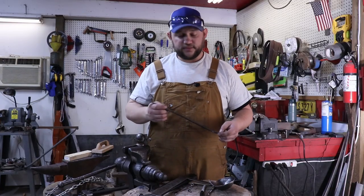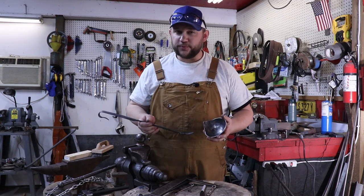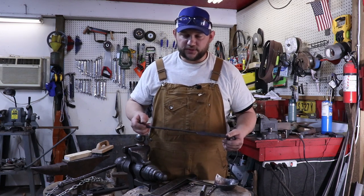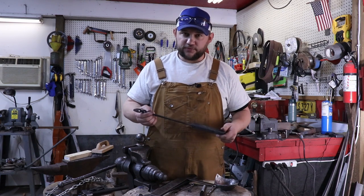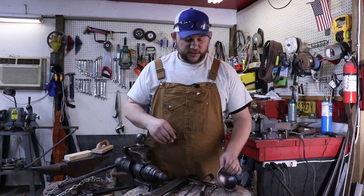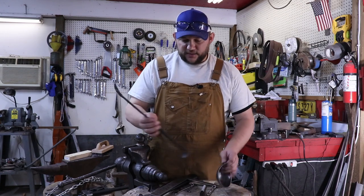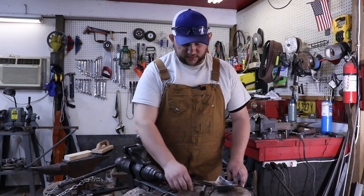Everything is drilled out. Now all I have to do is take this inside, and I need to wash it pretty good. I like to knock all the forge scale off if there is any with a wire wheel. Take it inside and scrub it a few times with just dish soap, and I'll bring it outside and then go ahead and heat it back up in the forge just slightly, and then finish it with beeswax, both of them, because once these are together, I mean, that's it. So to make sure there's beeswax, the coating behind the handle, that's what I like to do, and then I'll go ahead and cold rivet the rest of this handle in.